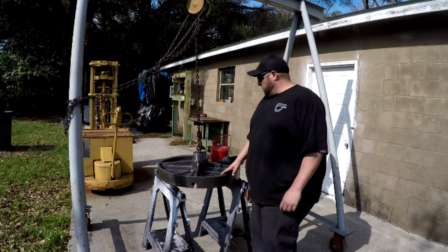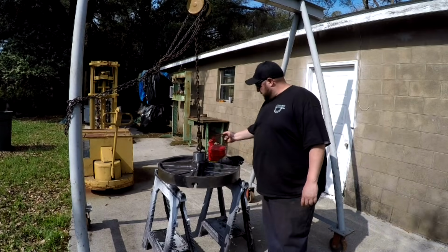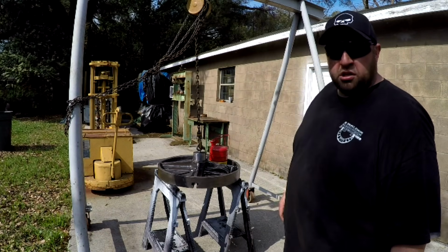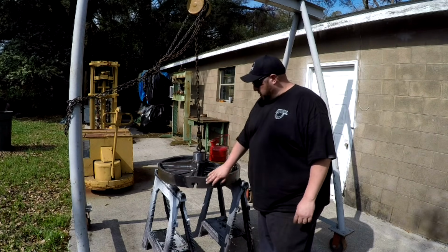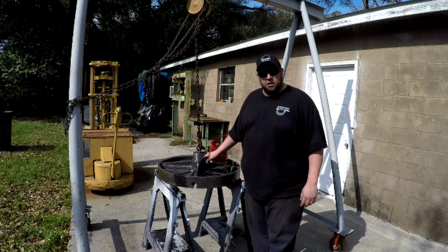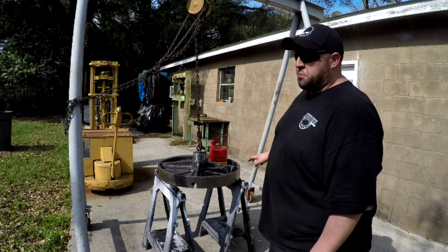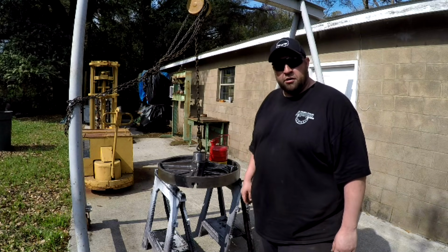But what I'm gonna do now is go ahead and clean it real good. I've got my solvent that I like to use right here, and got some gloves, got some clean rags, and we're gonna give it a good wipe down. And once I do that, I'm probably gonna do just a little bit of taping. I'll tape this edge here, try to create a nice barrier here for the side also, and I might unscrew this and put a little bit of tape right here, because this does face up to the shaft. So I want to keep this edge bare metal here, and the rest of it I'm just going to paint. And I believe if any overspray happens to go through and get on the bottom, that's no big deal, because we can just dress that with a grinder and Scotch-Brite.